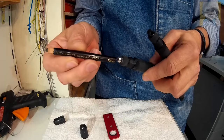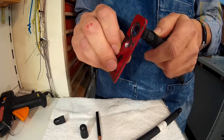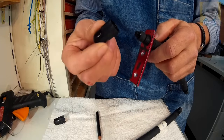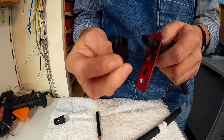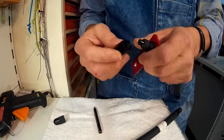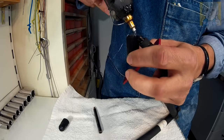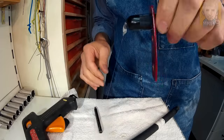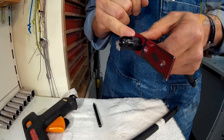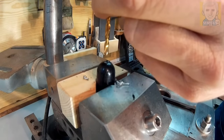I found this color pencil which is the same diameter as the ball bearing. I cut off a small piece and glue it on this rubber band. I also made this bracket that goes like this, and from an old wishbone — the V-shaped wire — I saved the cups. First I'm going to put some hot glue in, and the glue will fill up the area from the rubber band to the bottom. Now I just have to let it dry, then drill a hole on the bottom and thread it to 5 millimeters using a 4 millimeter drill and a 5 millimeter tap.